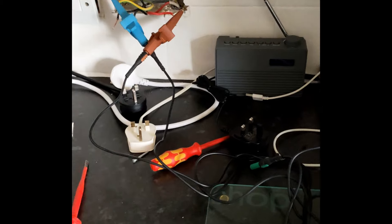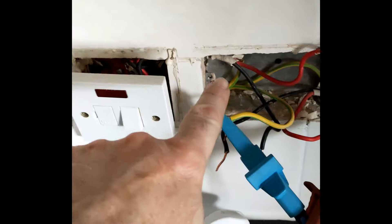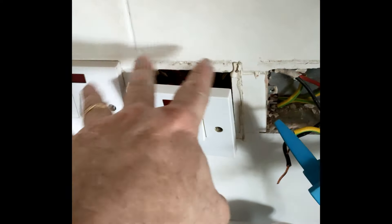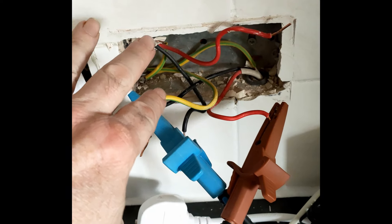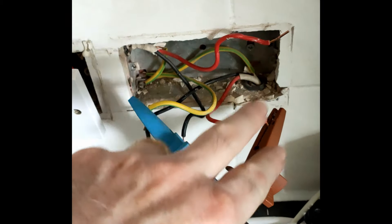We do appear to have solved the CPC problem, however I've taken some other covers off and there are CPC faults in those too — I've found broken CPCs and all sorts just hanging on for dear life. So I'm going to have to take every socket cover off at some point. The reason for doing this video is to document where I think we're up to. I'm going to turn this around — I think I've sussed the route of this ring. On this part of the ring I'm getting continuity, so incoming is here and this part of the ring appears fine up to this point. However this one isn't.